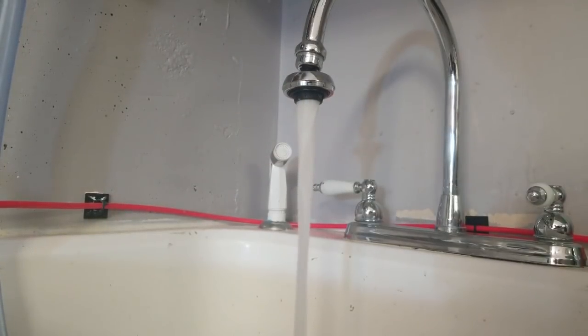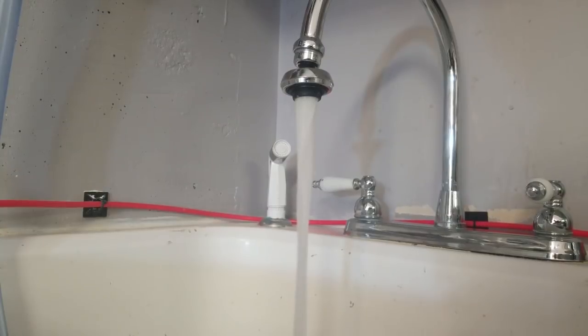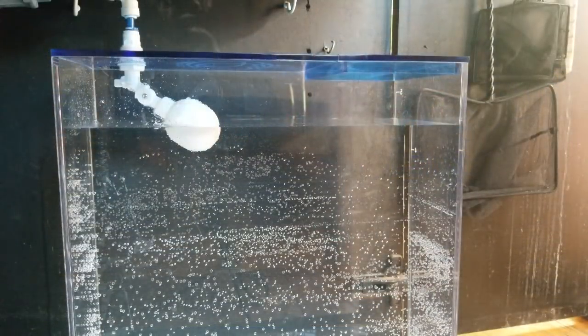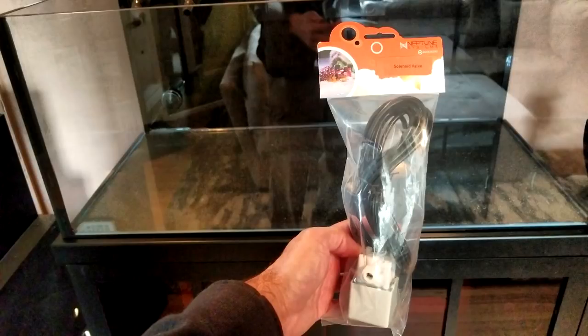Because this is an endless stream of water going into my living area, I want to make sure I'm not going to spring a leak and cause thousands of dollars in water damage, hike up my homeowner's insurance, and potentially even end my hobby. For this reason I have three levels of redundancy in place: a pre-installed float switch on the ATO reservoir, a leak controller, and an Apex solenoid.